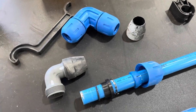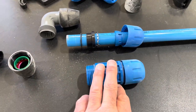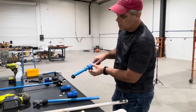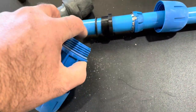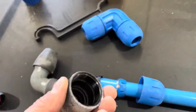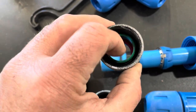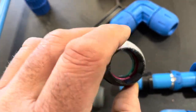Here's the difference between the fittings. These are the ones I got off Amazon — I believe these are the RapidAir ones. When you unscrew this fitting, the parts are loose inside, so if it's not on a piece of pipe they'll all fall out. You have to line a tab up with a notch, put the o-ring on the pipe, and slide it in before tightening. The other fitting type has a little interior bevel — all of the parts inside are contained within the fitting and won't fall out unless you physically knock them out.